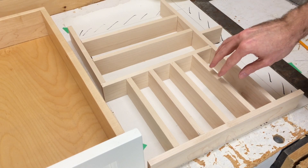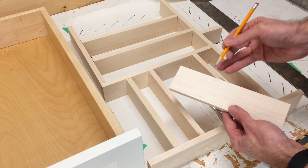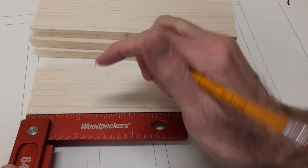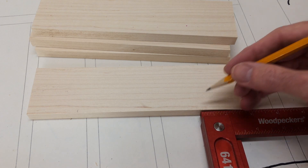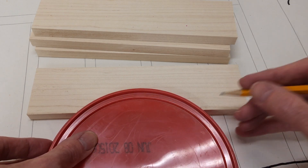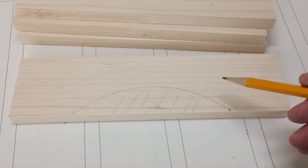What I want to do is make these a little more user friendly. Putting cutlery in here it's kind of narrow, especially with bigger hands. So what I want to do is cut away a piece here to sort of scallop the edges, and that will make it more accessible and easier to get to the cutlery. I measure in — in this case an inch and seven-eighths — from both sides. Then I take a round object, I'm just using a lid here from a container, line it up on either point, and just trace around it. This is what I'm going to cut out and then round over.